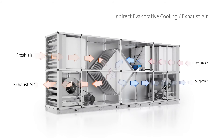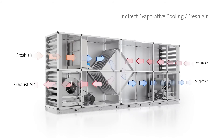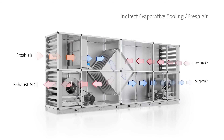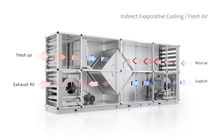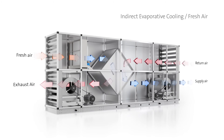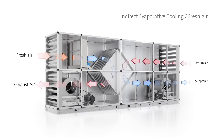When the air is extracted from the room, it is typically warmer than the incoming air and unsuitable for use in cooling it. Fresh air indirect evaporative cooling is a strategy that uses outside air to cool an internal environment without allowing external and internal airstreams to directly mix. Cool outside air is drawn through a heat recovery unit, then immediately exhausted, while internal air is drawn from the room and circulated through the heat recovery unit before being reintroduced to the room. The outside air's cool thermal energy is thus transferred to the internal air via the heat recovery unit without the two streams directly mixing.